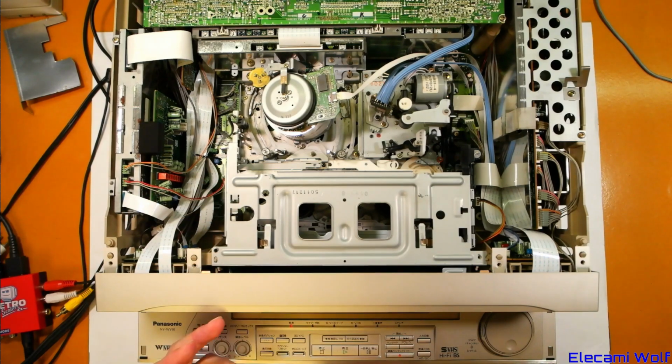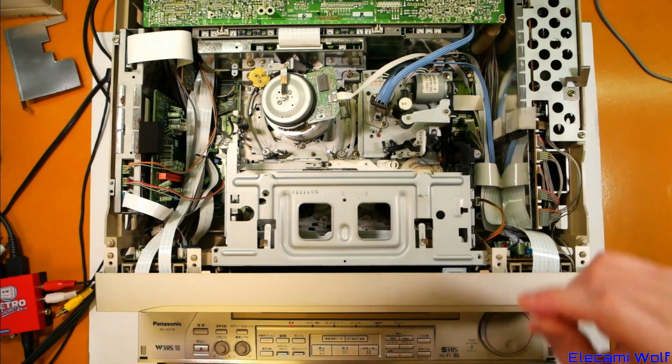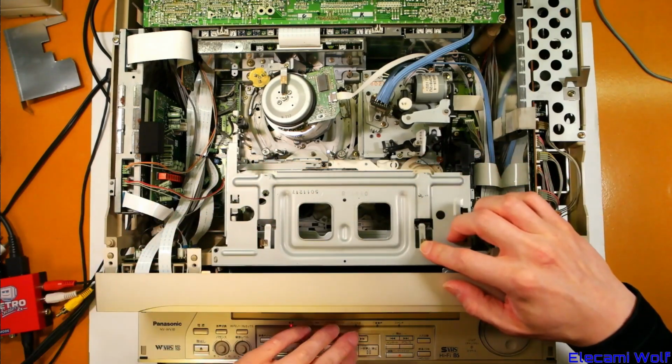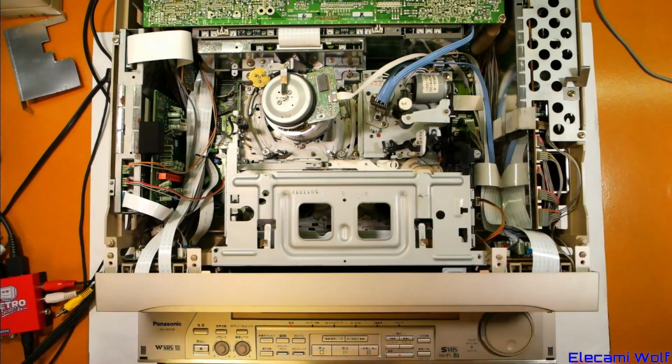But after putting it back together a couple of times and poking it around, manually winding it through all the states, then trying it with the cassette loading mechanism removed, holding the cassette in switch and running through all the play modes, everything worked perfectly. I couldn't find any problem. Put it back together, put tapes in, plays fine, hasn't had a problem since. I don't know why, maybe just wearing it in a bit got rid of the problem. Anyway, if I try and demonstrate it now, we'll see for sure whether there is a problem or not.